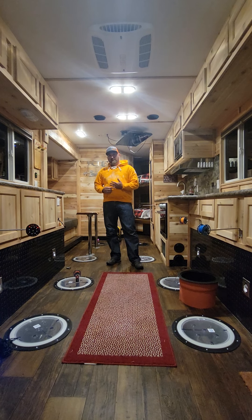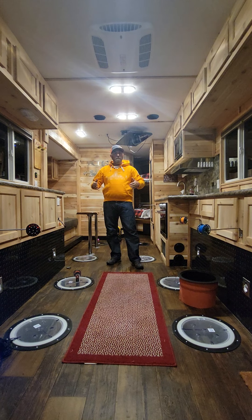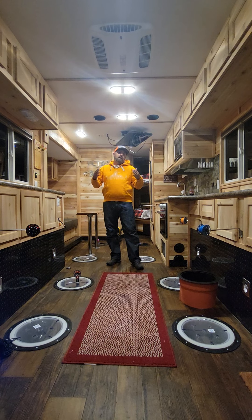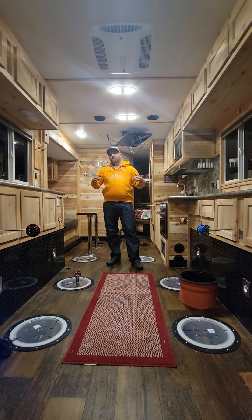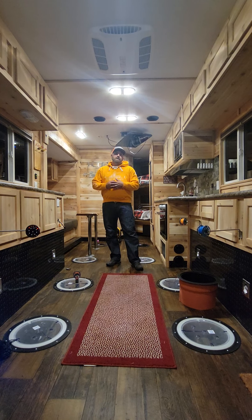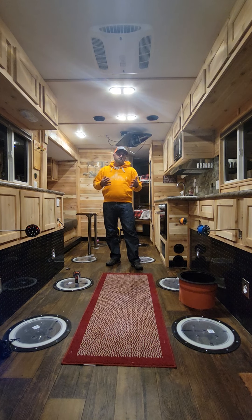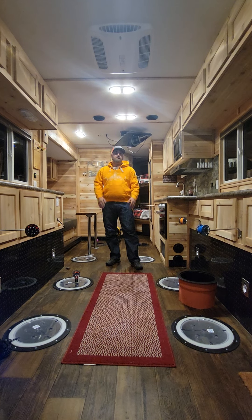A couple other things to make sure you do on a long weekend: wheel skirts are strongly recommended. Wheel skirts prevent the draft that tends to come in on the sides of the house where your wheels are. Also, frame skirts — we use both frame skirts and wheel skirts on our house, and it's amazing how much they impact when there's no banking from snow. If you can't bank with snow, those frame skirts give you a 360-degree seal of your frame to the ice, and the wheel skirts prevent wind from coming through that large open area.